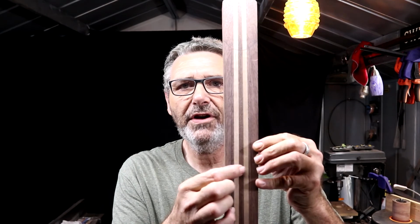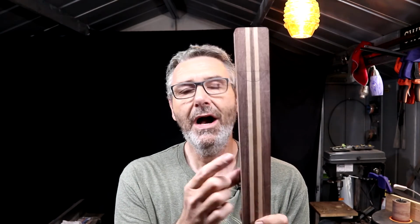I've got some lines drawn down through here. I've got some lines on the back. I've got one down the center, of course. And then you'll see I've got a line 2 millimeters on each side of my center line. I've got another line 10 millimeters from the edge out here. I've got a line 10 millimeters from this edge over to this line. Same thing on this side. I've also got a line marked that is 8 millimeters below my fretboard. Now I know this is a lot of information. What is actually important at this particular time is the line that is 10 millimeters from this edge that way and 10 millimeters from this edge that way on both sides.